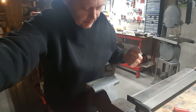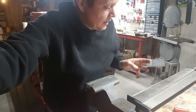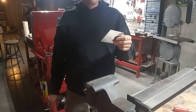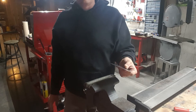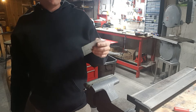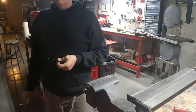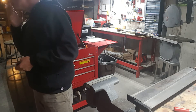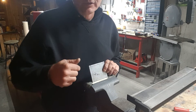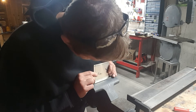What we've got to do now is take our six-inch vice and a ball-peen hammer and bend these things into shape, because sometimes a metal brake just doesn't do what you need. This is a good tip if you don't have a brake but want to bend a piece of aluminum to make some sort of bracket or trim piece — really anything as long as it's kind of small, since a vice is going to have some size limit. First thing is to put this in our vice and get our lines lined up.